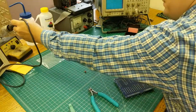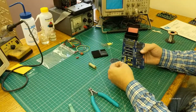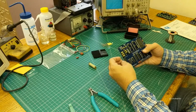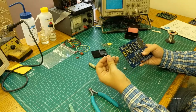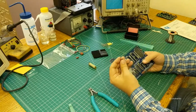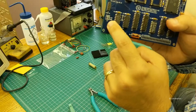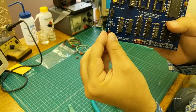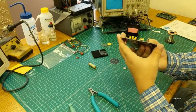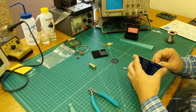We had been doing press fit holes for these, but I'm not sure if it's manufacturer variability in the headers or if it's variability at the circuit board house we use, but sometimes they're so tight you just about can't get them in. We do press fit the Molex headers, so you want to make sure these are going the right way. You'll see up here there's a line off to one side. That's the end that the tab should be on, so you want to have it with the tab toward that double line. And they are press fit, so you have to sort of wiggle them just a little bit to get them to drop in there.